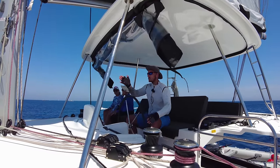Make sure that this face is nice and smooth, or just protect your boat. Another good thing about the fat fenders is that they keep a much bigger distance from the pier. Because if there's a ring like this, a small ring and a big ring, and you go with just a skinny fender and the boat pushes in a lot, the fender will squeeze and you can crash into this ring and make a hole in your boat. So that's why I always have plenty of these fat fenders. I would say four is minimum, but six would be even better.